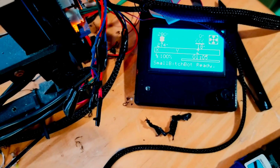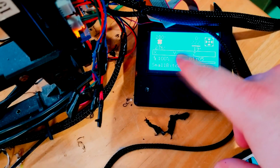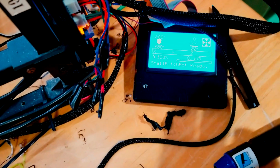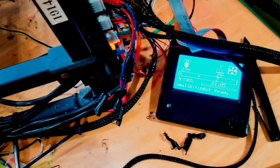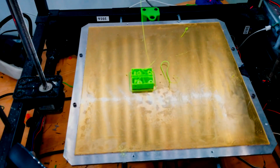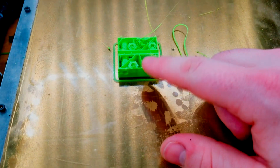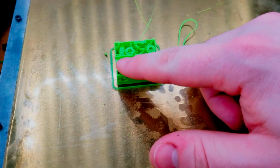First, kind of an effective demo as to what I was talking about in terms of gumming up. So here we have my hot end floating in the range of 280 degrees Celsius, which is way over where PLA should be. So if this was the time that PLA would jam, that is where it should jam. So here's actually one of the failed prints. As you can see in there, we're getting a whole bunch of little sticky, drippy nonsense, really weak infill. It's just not working right.